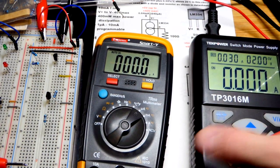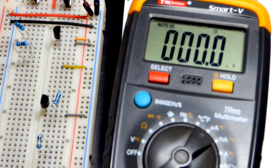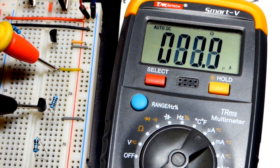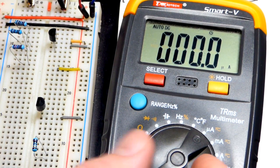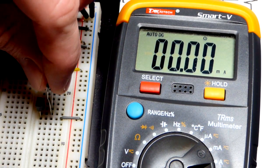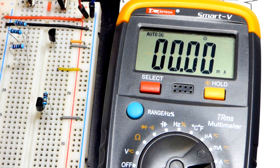Let's go to 2 volts at the power supply. The alligator clips come from the power supply and jumpers go to the rail. We should see the same amount of current with the same resistor. Going back to the milliamp range with the 10-ohm resistor — you've got to be aware of these limitations. This component will work down to 1 volt, but only with a very low current.